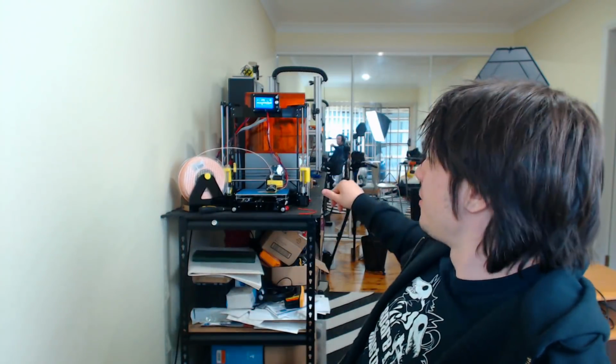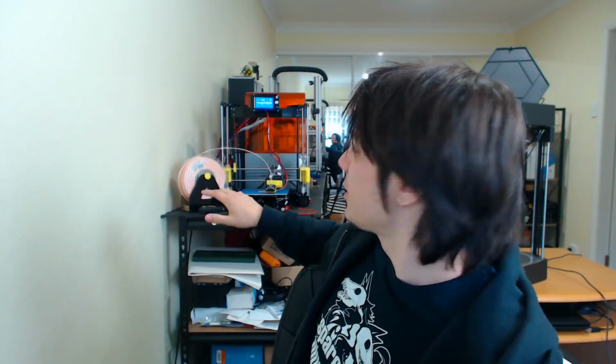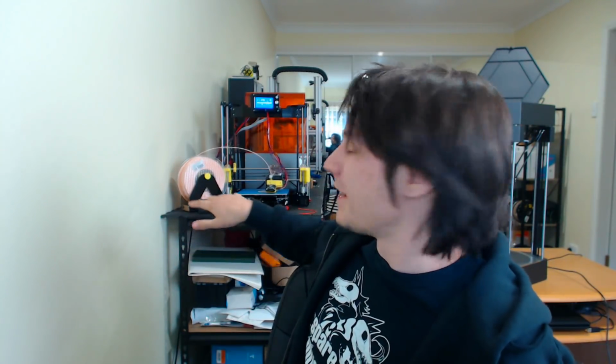Anyway, the raised cube is currently printing a modified version of the torture test, which just has a single cube. I'm trying to dial in the retraction and stop it stringing, because essentially this is my first test. It broke and it's stringing, which is awful. That was just on default out of Slicer. I think that although the machine has 2 fans, they're not spinning very fast. I think they're just very low quality, low power fans, and it's not cooling it very well.